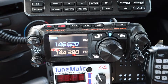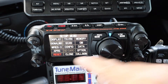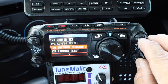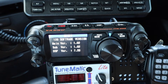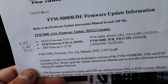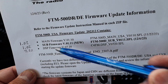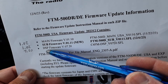To confirm the firmware version, go to Function, then Reset — that's Menu option number 126, Software Version. Select that and write down those numbers. I've written down the current firmware from the radio so I know what needs updating.